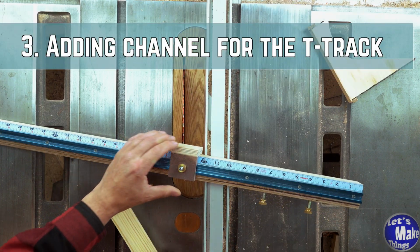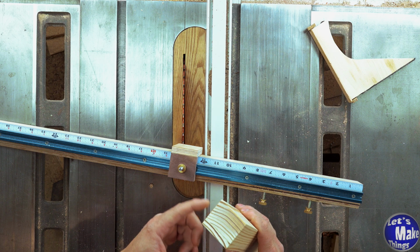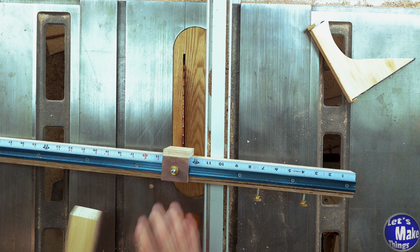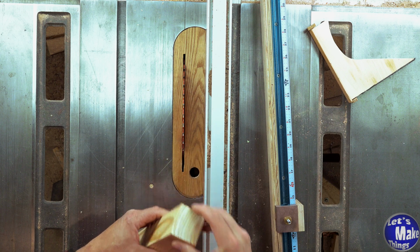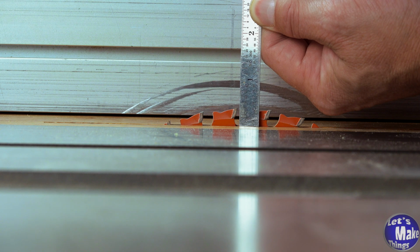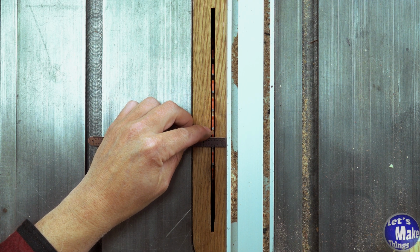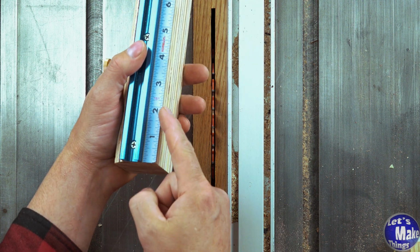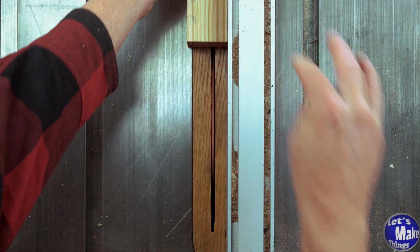Just like the stop block that I made, I need this to sit so that the track fits inside the bottom part here. My channel is going to be 3/4 inch, so I need to cut that 3/4 inch out on the bottom. Just like before, I need to set my blade at 3/8 inch, which is the thickness of my track. And I'll move my fence so that it's 17/32 away from the blade. And that's just going to be the width between my track and my edge. Mine happens to be 17/32 inch.